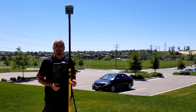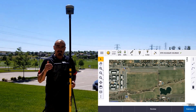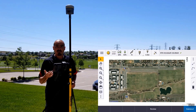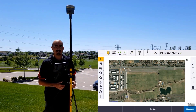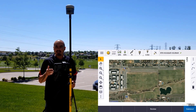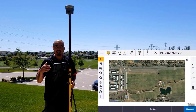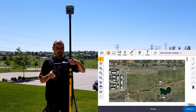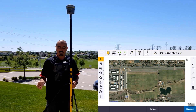We've done testing from northern Colorado down to southern Colorado on NGS monuments and are seeing that consistency once we hit seven hundredths on the vertical precisions. My project is set up on a no-projection, no-datum system, and I've entered my site control. This is an arbitrary coordinate system — something like you'd see on a constructed site where you're trying to match surveying control that's been provided to you on a non-published coordinate system.